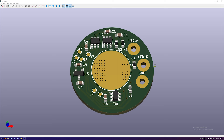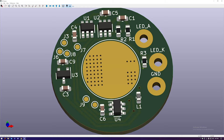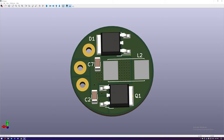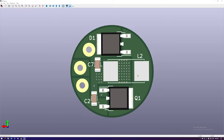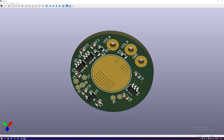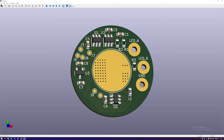Now it's just time to head over to the board editor and turn this into a reality. Here I've already imported the components and have to squeeze them into a 26mm diameter circle — that's the size of the existing board and I can't go any bigger since it has to fit into the aluminium head. Many hours later, I've finally finished my board. We've got the three big terminals for the LED anode, cathode, and ground. Battery positive is this massive central pad, replicating the spring pad from the original board. Looking at the 3D view, I've basically got a high power side and a low power side. The back has the MOSFET at the bottom, then the Schottky diode, with big fills across the whole side to help with heat dissipation from the MOSFET and diode, and the gate drive powered through a via.